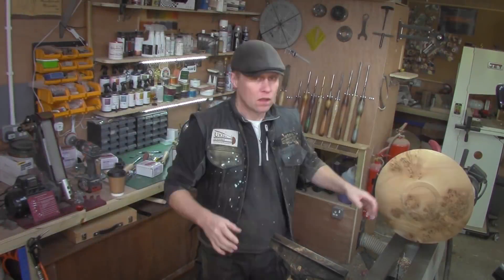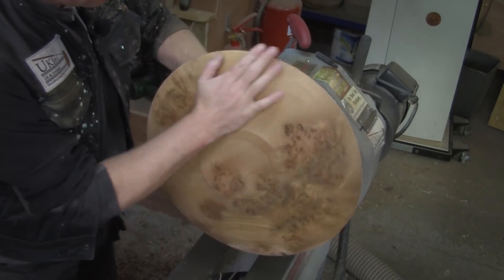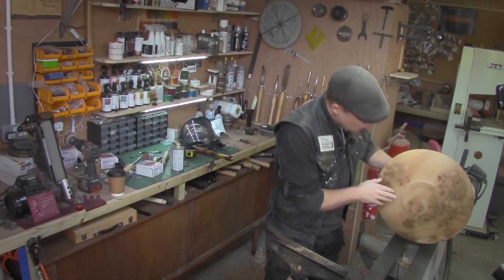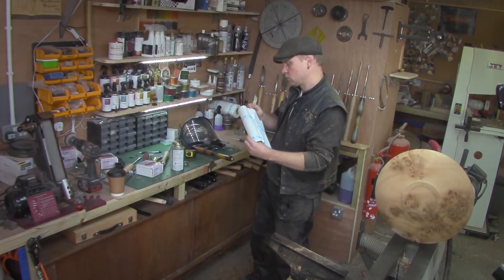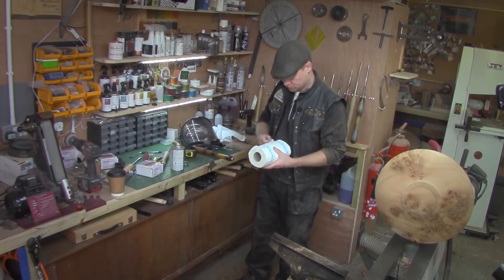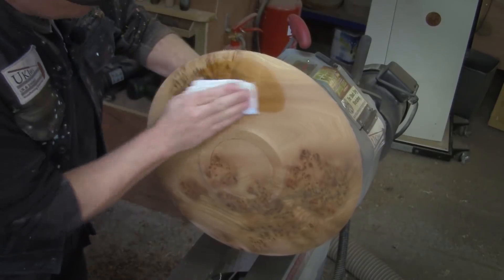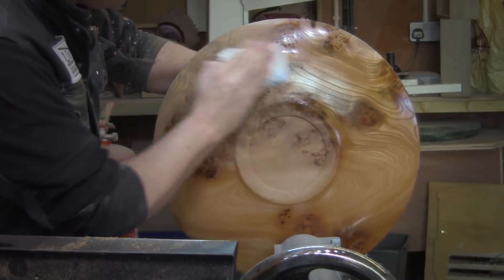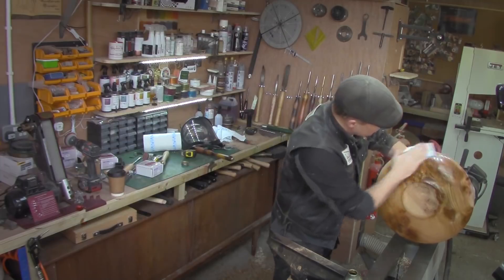I think that has come out absolutely beautifully - sanded down to 400 and I've blown as much of the dust out of all of the inclusions and stuff as possible, and also as much as I can out of the grain. I'm really pleased with how it's turned out. So I'm going to put at least one coat of oil on - I'll see how it looks after the first coat and decide whether I'm going to put a second one on. I want to bring out as much of the figure on the bottom of the piece as possible, so I'm going to put some Danish oil on. The oil is going in and it's really bringing out the figure, and just look at this green line running around here - there's loads of green in the piece which is going to look absolutely fantastic.